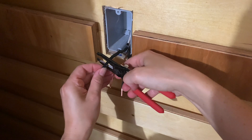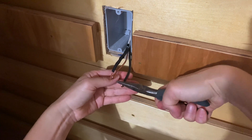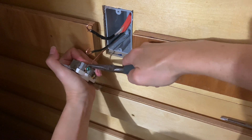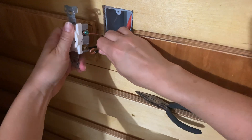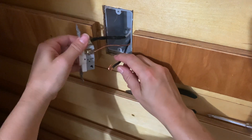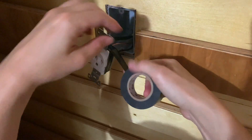Using the wire cutters, I'll strip a section from the end of each of the hot wires. Then I'll use a pair of needle nose pliers to loop the ends of the wires. I'll secure the ground wire to the green screw. I like to just squeeze the wires into place. You'll notice that I'm also wrapping the wires so that when I tighten the screw, it actually tightens it farther into place. I'll then hook the first black wire to the golden screw, then attach the second black wire to the second golden screw. I like to wrap my outlets in electrical tape just to secure everything in place — it also provides a little bit of extra protection if you go later to work in the box.